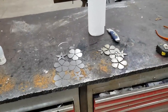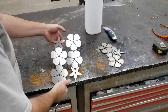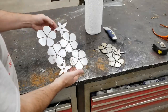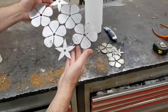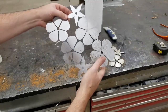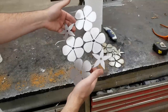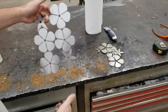Here's a quick side-by-side review of plasma versus laser on 20-gauge material. That's the front side on the laser — you can see all of our bridges are intact, and those are 60-thousandths bridges. That's the back of it. This was just a scrap piece I had laying around with some rust, and I did run it through the belt sander. We used the same piece on both, and by putting a grain on it with the belt sander, you can see right off the laser you could paint it, powder coat it, bend it, heat treat it — whatever you're ready to do.